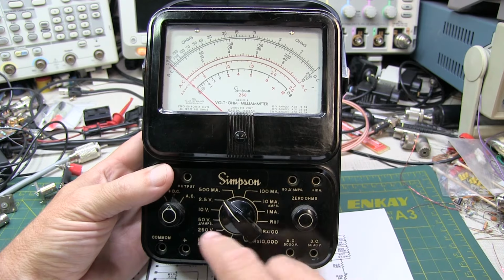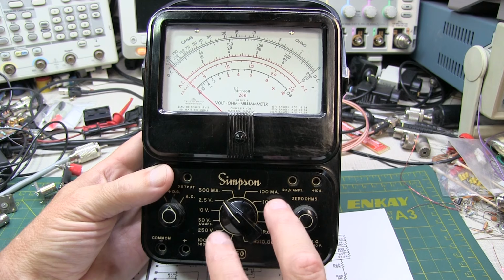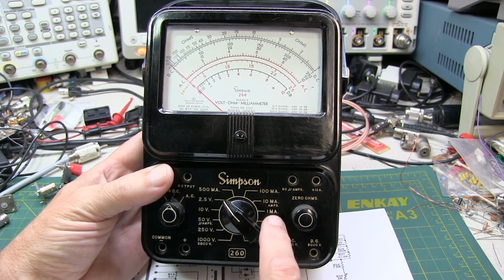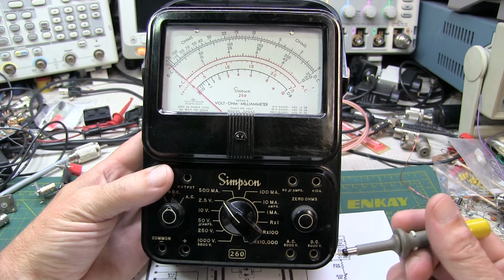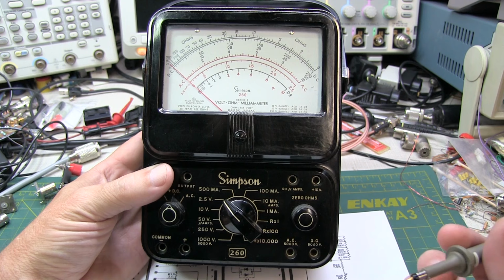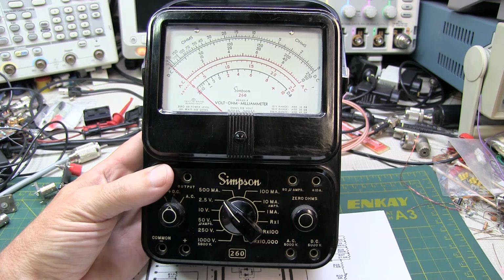or any of the older equipment before everything was all electronically switched are a pretty common request. So today we're going to take a look at these multi-wafer, multi-position switches and how they're represented in the schematic and how to interpret them. Because oftentimes, depending on the piece of equipment, they're drawn or represented in the schematic a little bit differently. So I'll show two examples here of how to interpret these switches.